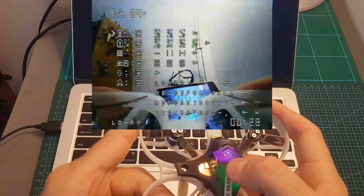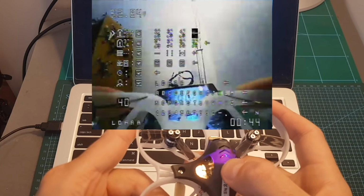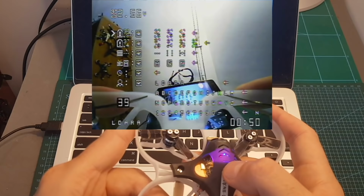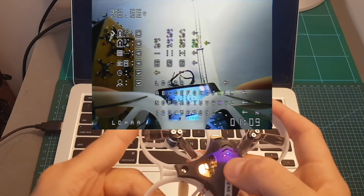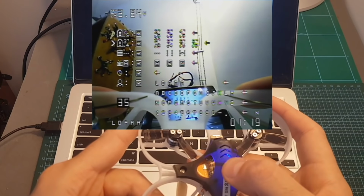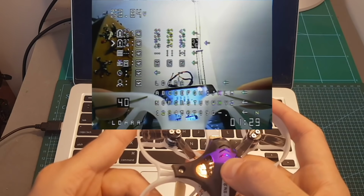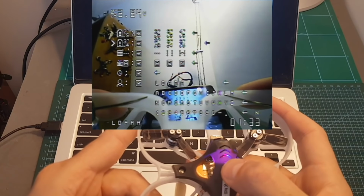And if you are going to short press this button again, you'll be able to set different types of batteries. So for example, you can set it to 3S LiPo battery by long pressing this option. Now, of course, the battery voltage was reduced. So the default option is 2S, and you just need to leave it this way. Next, you can set up the battery warning. So you can set the voltage between 3.3, 3.4, 3.5, and 3.6 volts. I recommend to set it to 3.3 volts.